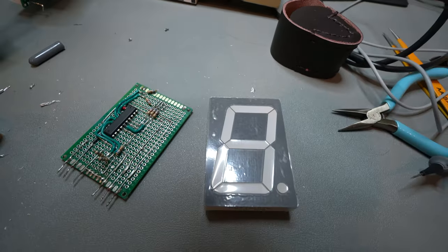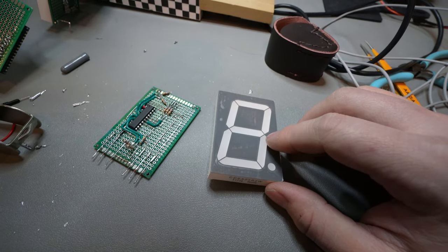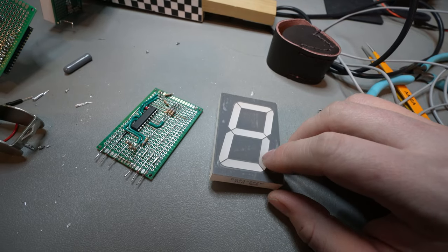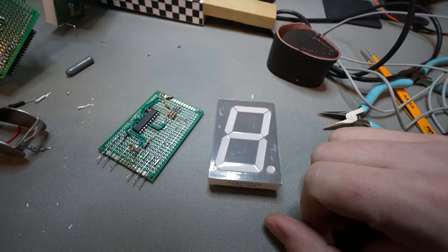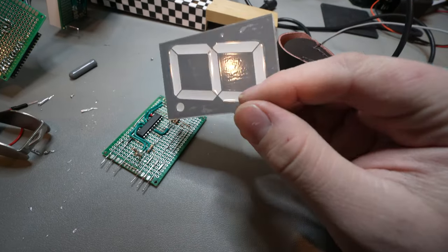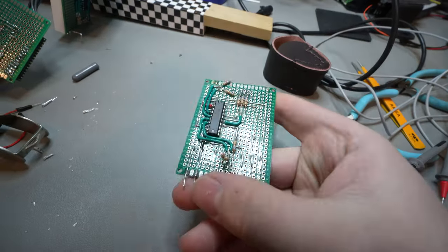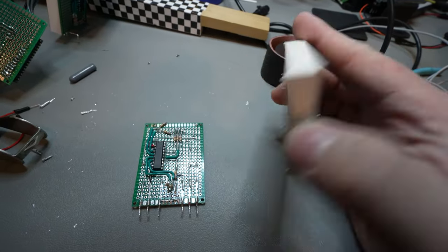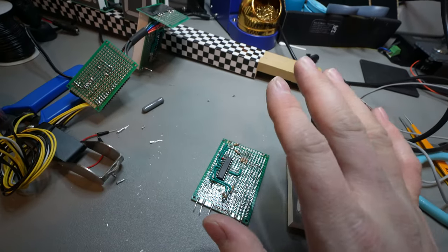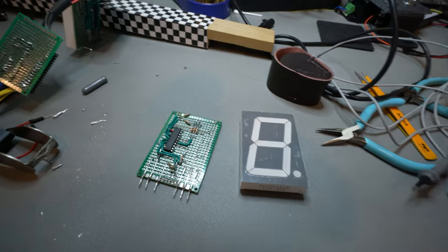I don't know. Yeah, I guess what I probably did was touch the high side. So we had 12 volts coming in, and I probably touched the low side to ground, and then just burnt up all the LEDs on there, and so now they're just kind of shorted out. So I'm gonna have to go get a new display. But luckily, I think we can still use this board. So I'll order some new displays. We can put that in, put it together, and then everything should be working. Oh, man.